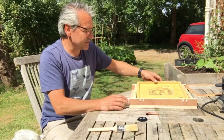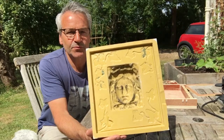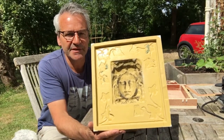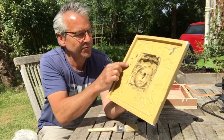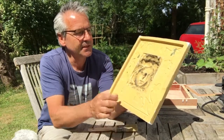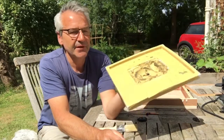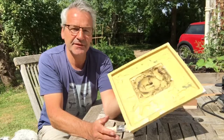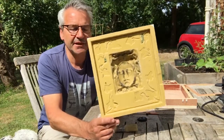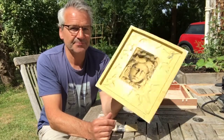Hi, okay, so just to wrap up this video, I've come out in the garden because it's a lovely day. Separated the mould. That has worked really, really well. There's quite a bit of cleaning up to do. I've got some spare silicone that's sort of seeped underneath the leaves, which needs cleaning up. A bit of the clay is in here as well. But that's basically ready to have the back put on it. I'm not going to do that in this video. I'll do that either in the next video or skip straight to the lead pour. But pretty happy with the results.